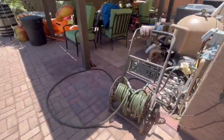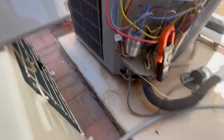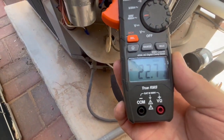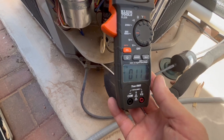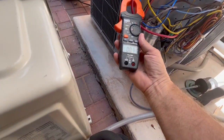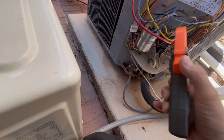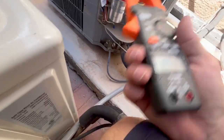So pretty nice being able to run my whole house air conditioners upstairs and downstairs off of just solar. I walk in from that garage to this inside. It is cold. So here we go, outside, and we have both of them running. And I doubt, oh, it did give us. So it was 22.7 inrush on that last one start. And if we get rid of that, we're running 11 amps right now. So, see, 7 amps on that, and 9 amps. So it's around 20 amps between the two.